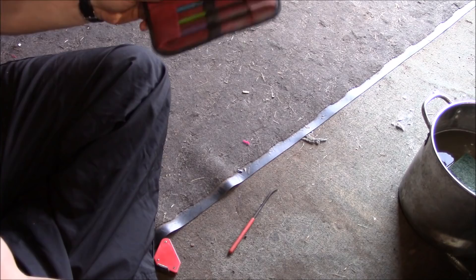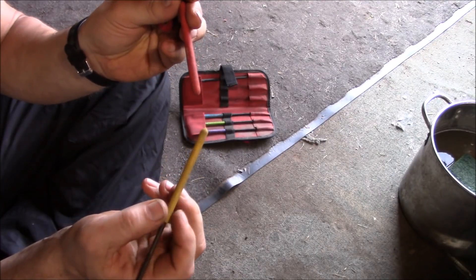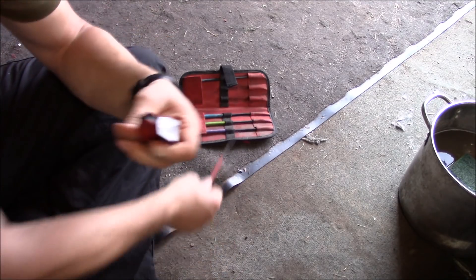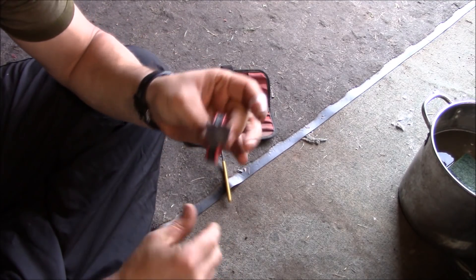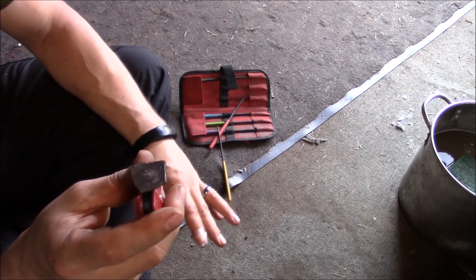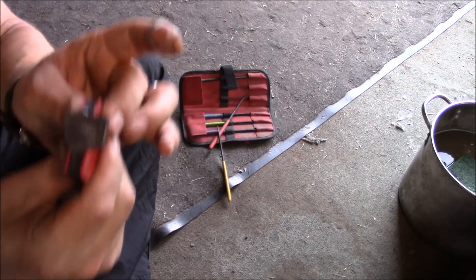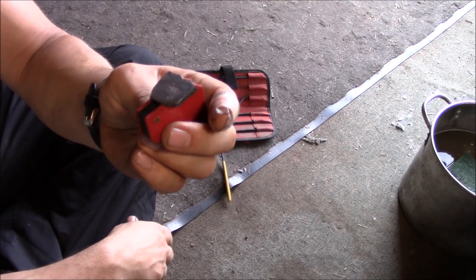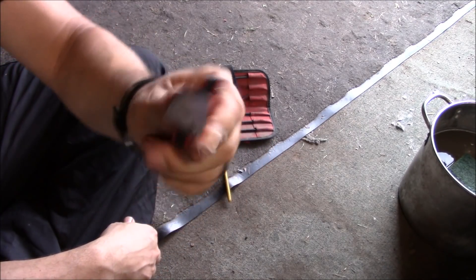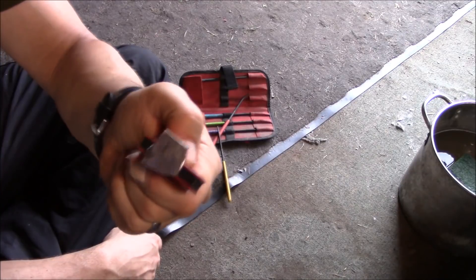After testing it out, this little piece here is somewhere between HRC 55 and HRC 60 — that's not bad, that's pretty good. My last knife was right around 60. The 60 file barely nipped it, kind of skated a bit, while the 55 cut in a little, so this is somewhere between 55 and 60. That's knife-quality hardness — you're going to hold a pretty good edge at that hardness. I'm pretty pleased and getting excited about this knife build based on the qualities of this steel.